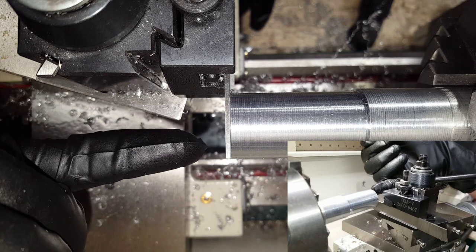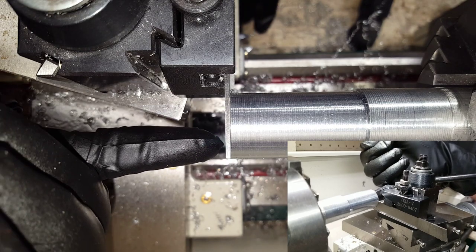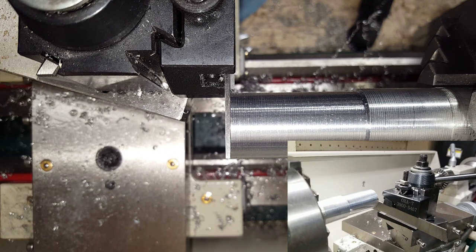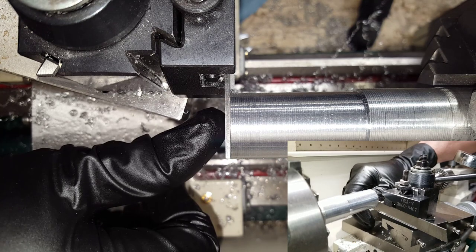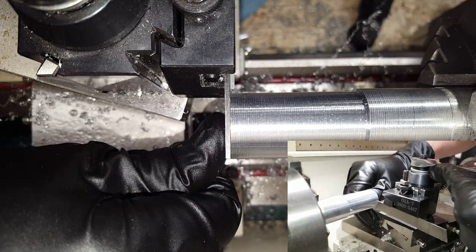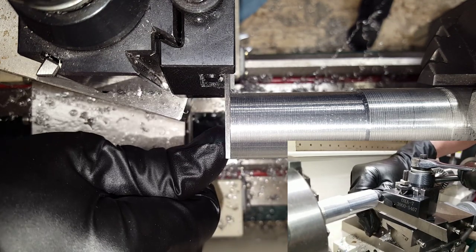This is important because once you start cutting you don't want the blade going in at any sort of angle. So right here it looks to be completely perpendicular. While applying pressure to the blade I'm going to tighten down my tool post. You need to be careful that when you're tightening it down your tool post does not rotate and throw your alignment back off.